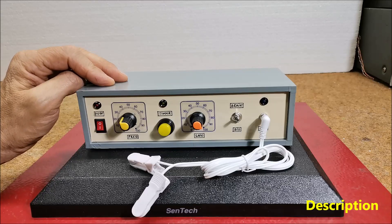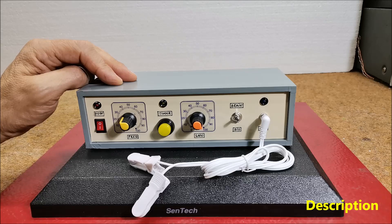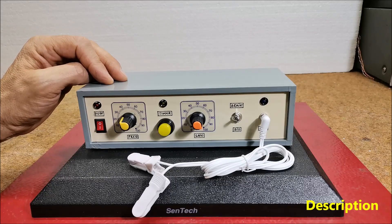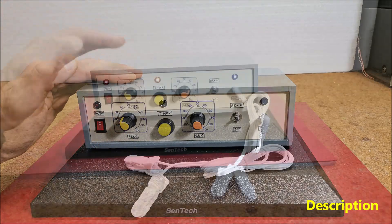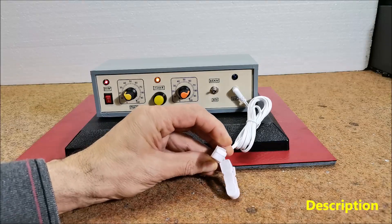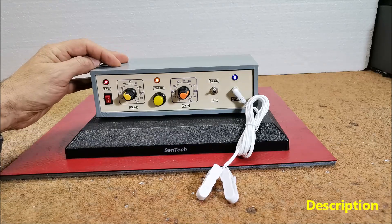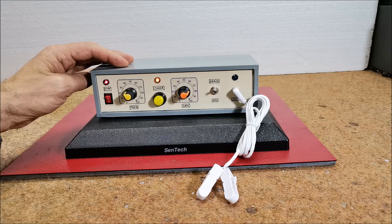Arduino generates two frequencies, 111 and 1110 Hz, modulated by a third one, and all of them multiplied by an audio transformer and applied to the ear lobes. To use the brain tuner, it's simply a matter of attaching ear clips with conductive rubber electrodes to the ear lobes. For relaxation purposes, typical use is from 20 to 40 minutes a day for up to 30 days in order to enjoy lasting effects.